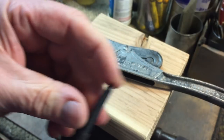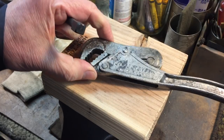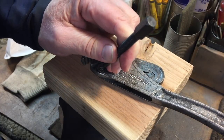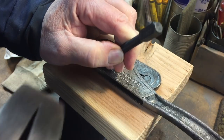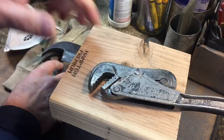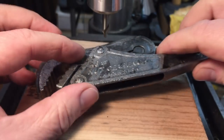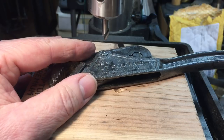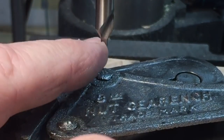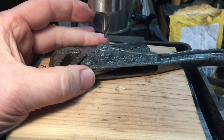Now to drill out these rivets: get yourself a nice sharp punch, try to get close to the center, and give it a light tap. Look at it and see where it is — this one's off a little bit to the right, so you angle your punch and drive that dimple a little to the left. By manipulating that hole back and forth you can get it perfectly centered. That's the first step. Once you're happy with the dimple from your punch, use your spot drill — also called a center drill — and bring it down right into the center. These are a must for every shop because they don't wobble and they're very strong.